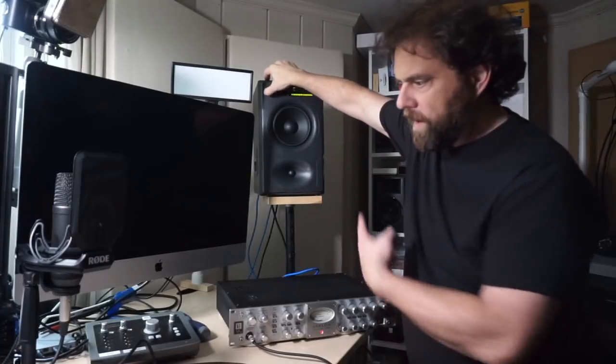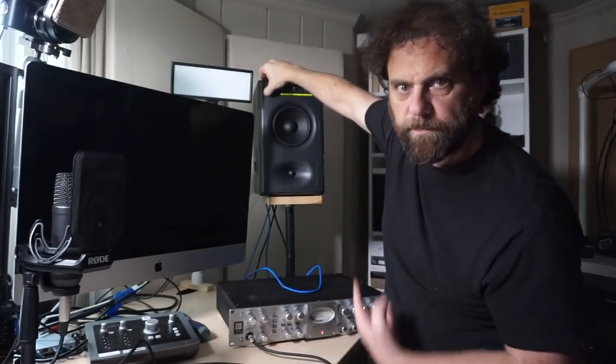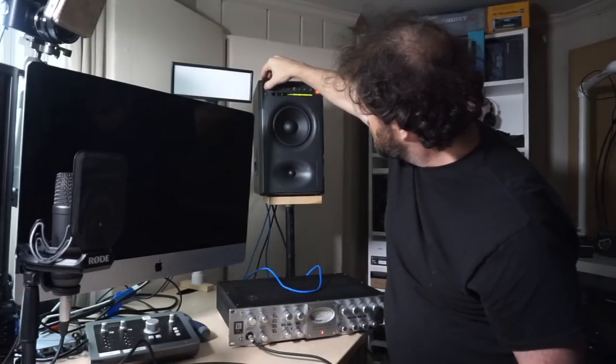Hey, this is Mike. Thanks for helping me troubleshoot this, and hopefully this helps the people at Avalon. Right now in my studio, the only thing that's plugged in is a monitor, my interface, and the Avalon — they're plugged into a Furman power conditioner. It's the only thing plugged in the whole room, except for my battery-operated lantern. The Avalon is connected with an XLR to tip-ring-sleeve balanced cable, and this is the hum I get. I hope that helps and can help us diagnose what it would take to fix it. I'm really eager to have it fixed.